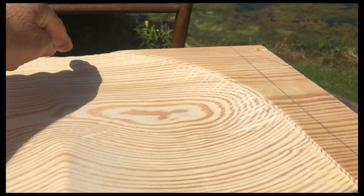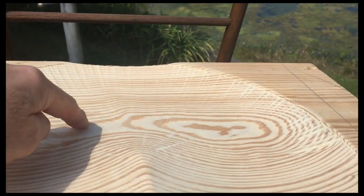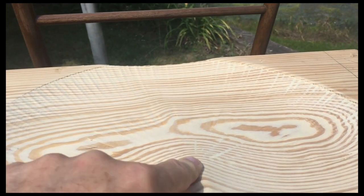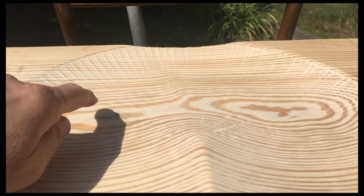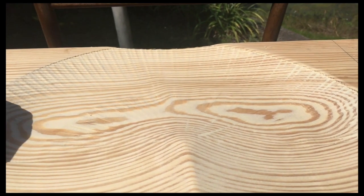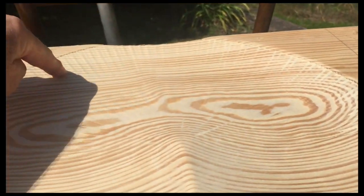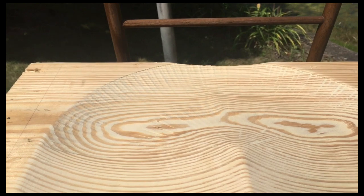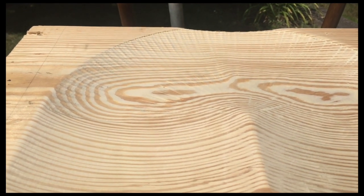I figured out what caused the ripples. What I did is I shortened up the length of the vectors — they all terminated here, and I cut half of them back two inches to save motion. But when I did that, the software actually calculates the depth of five-eighths of an inch across the full length of each vector. So when one vector is longer and the next is shorter, it changes where that depth falls and changes the radius of the cut, creating ripples. I thought I was saving time, but it went from smooth to rippled — that was my fault. But it turned out alright for a first attempt, so keep that in mind and have fun playing with your CNC.